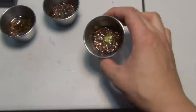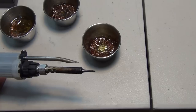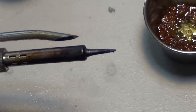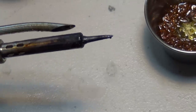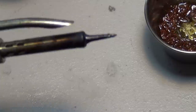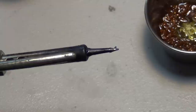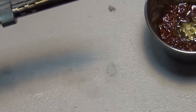Are you tired of your soldering iron looking like crap after soldering? After a while, the coating on the soldering iron can go bad and you can get rust. If you don't take good care, or if you use too high a temperature like I do — 300 to 400 degrees Celsius, sometimes even higher — and you leave your iron on too long, it gets crusty, it gets rusty. Depending on the flux you use, it could be corrosive and the iron could just look terrible.